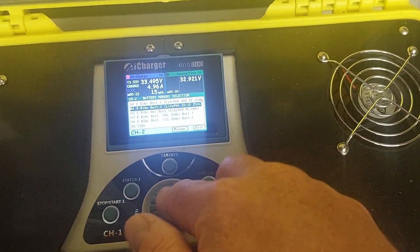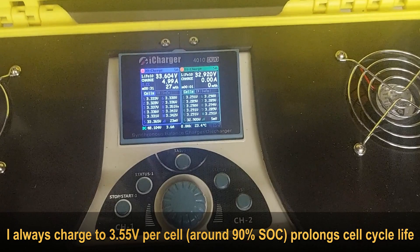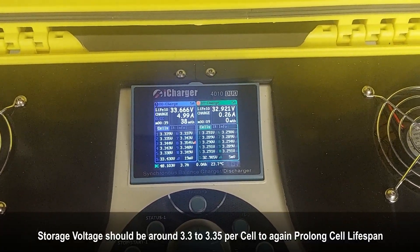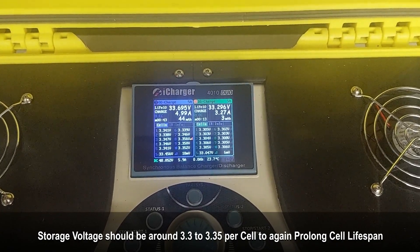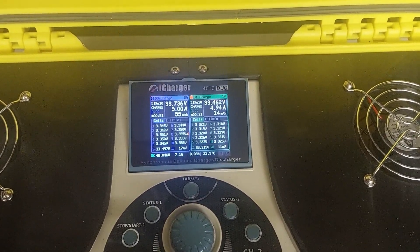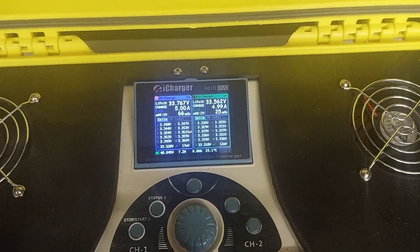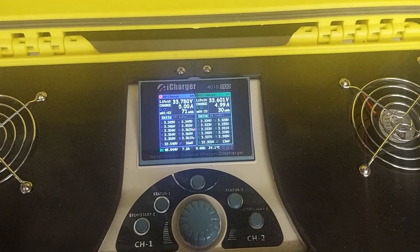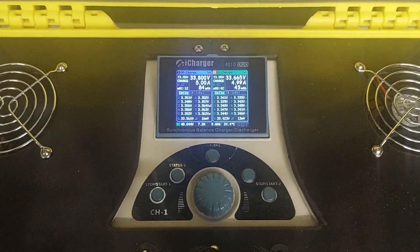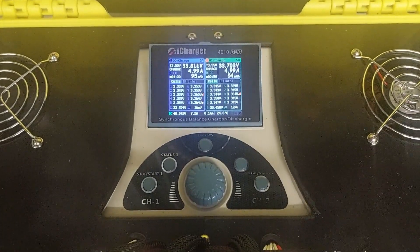Once you get to the top part of the battery it will reduce the current so it can balance properly — it's ramping up to five amps now. Then I'll do the second one — ramp up. Alright, it's charging and balancing as we speak. It's a five amp-hour battery, probably only half discharged at this point, which is good — I leave it at storage charge, about half capacity. That'll take three to four hours to get a proper top-end balance.